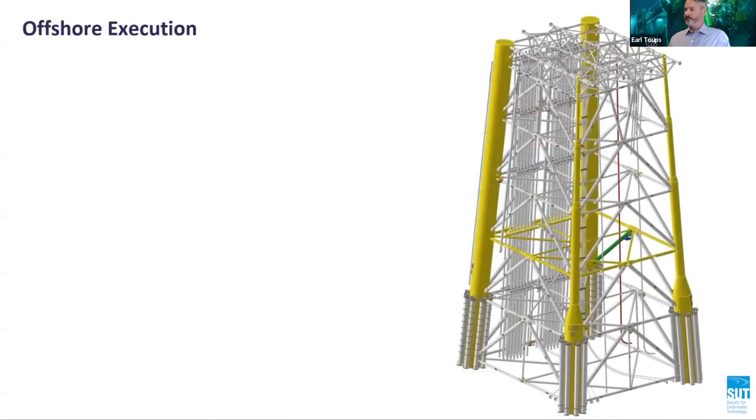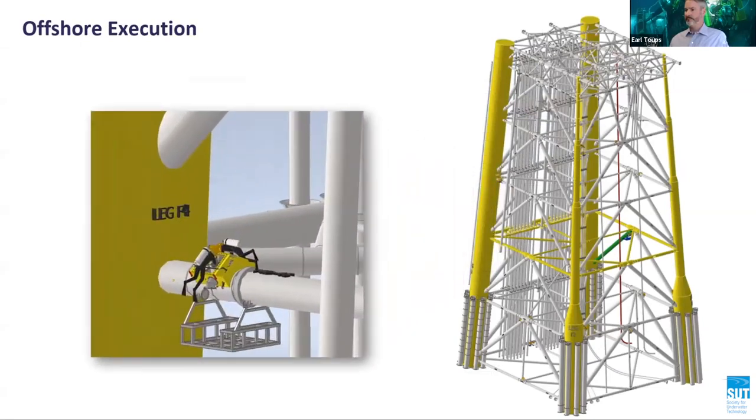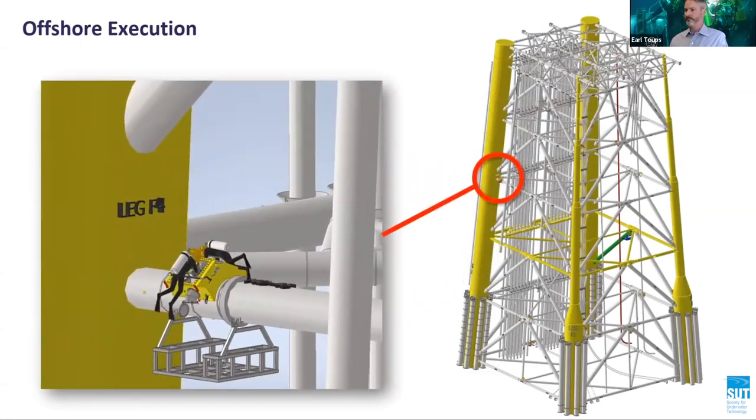The world's first microhabitat weld repair was successfully executed by DCN Diving in July 2020. The defect was a through thickness crack with a total length of 567 millimeters situated on a horizontal jacket member at minus 46 meters water depth. The closure weld in which the defect was found had been repaired several times previously and therefore had existing backing bars in place, adding additional complexity to the repair.